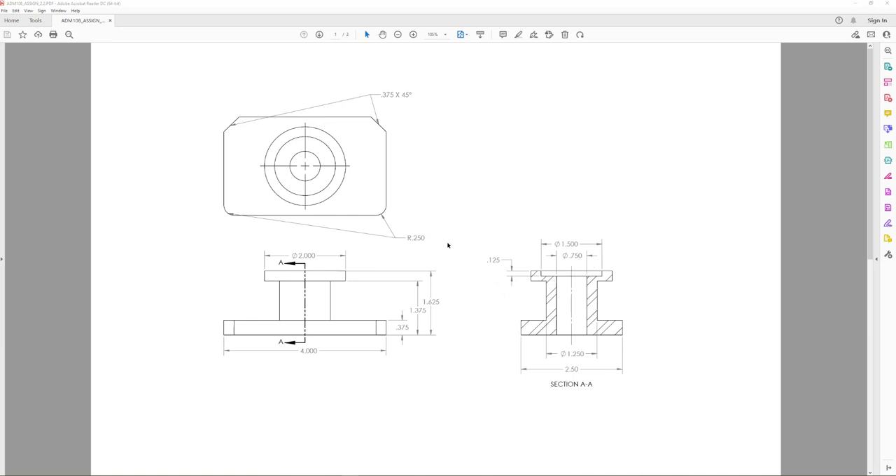Now I want to introduce you to a couple of new things you haven't seen in class yet. These are little radiuses called a fillet, and we're going to add them with a feature command inside of the model. We could do this with a sketch but it's usually a little more difficult. I also like to put these on at the very end of the model, just in case somebody wants to do some machining and needs to turn them on or off — sometimes they can become problematic if you're in the middle of your model and have to make a change.